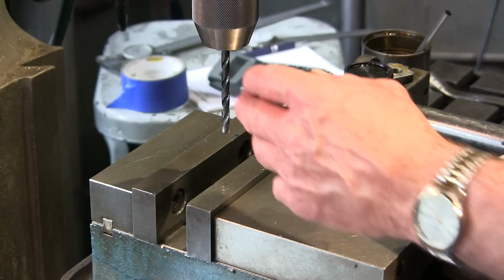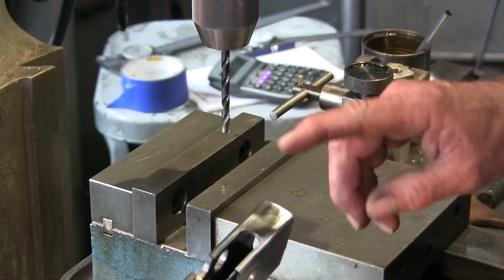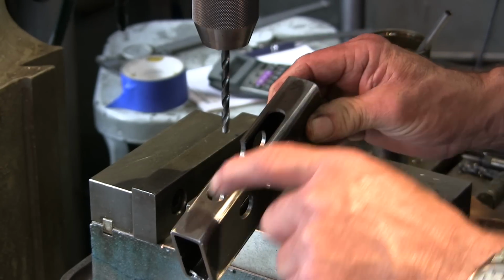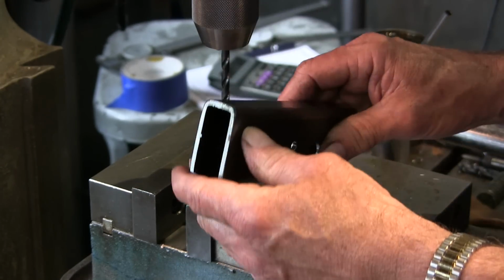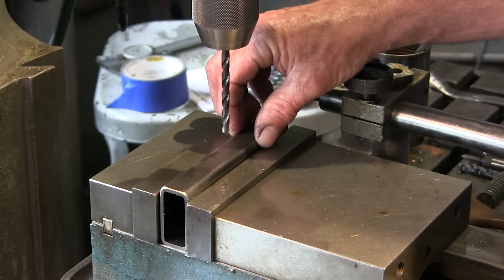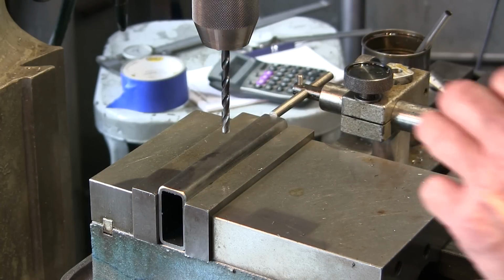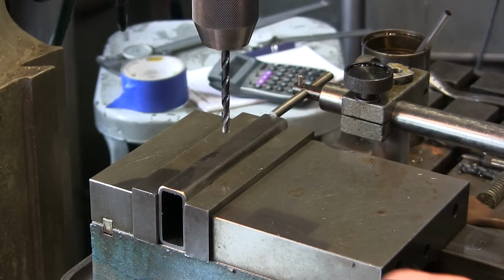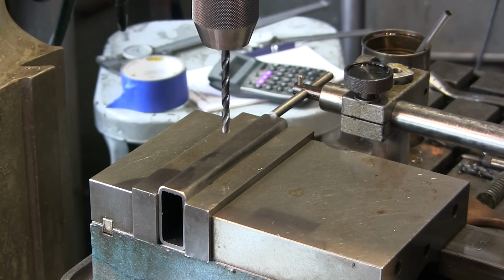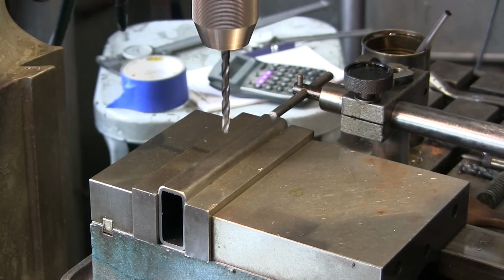Okay, we're going back into the quarter inch bit drilling mode. And we got 5 holes to put in on the 1-inch side. So each of these ends here will get a hole. And right in the center of the bottom of this, I'm putting a 1/4-inch hole. And I'll explain to you when I get done with the project and assembling these, what that 1/4-inch hole is for. And I did leave it out on the drawings.